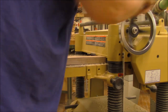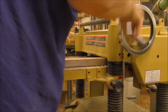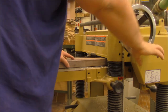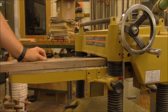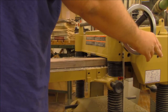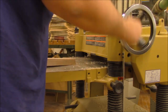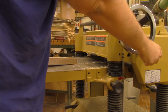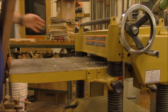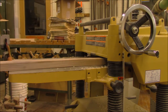I'm dropping the table and I slide my board in. Wherever it grabs the board tight, that's about where I want to be. I'm going to look at this — I know this is about five o'clock. I back it up, pull the board out, reset it to five, maybe sneak it just a hair closer to six for my first pass. I'm going to turn on the planer and send the board through.